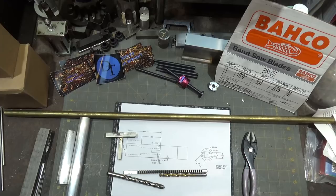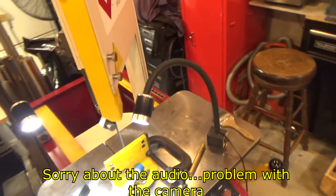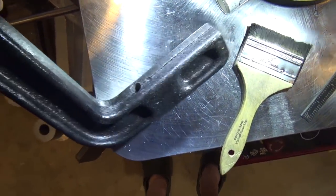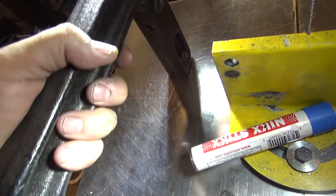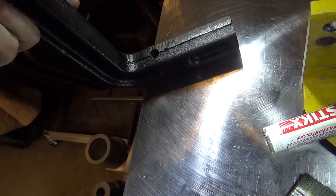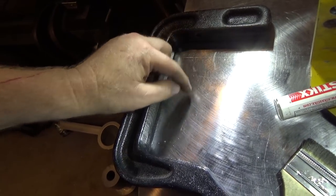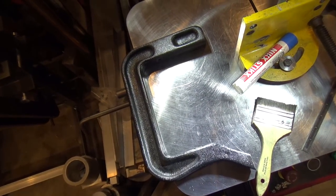I'm going to have to make another stop at some point. The Baxter VertiCut has been a very good saw, but some things are lacking. So if you look at this — this is a very rough casting, this is the clamp. This portion right here is what pulls against the stock, and since it's at a significant angle, it doesn't pull very evenly. So I'm going to machine this to a flat surface. These other ones don't really matter — nothing really matters other than that, relative to the shaft that goes down the middle. So we're going to pop over the milling machine and fix that real quick.